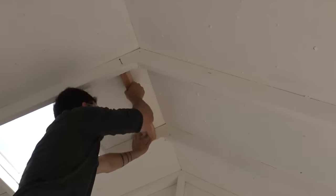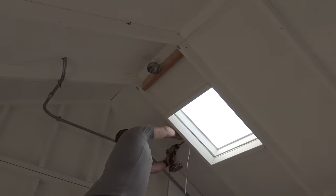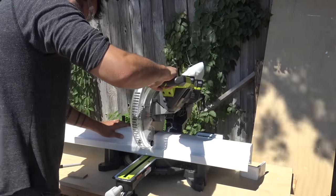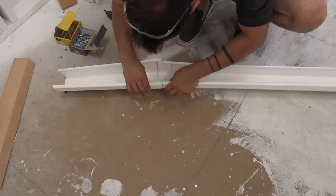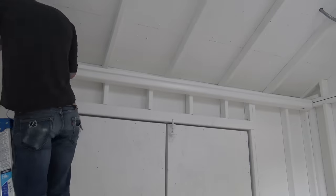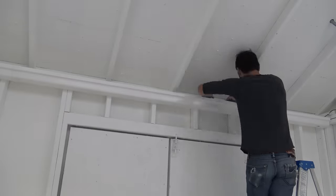We now turned our focus to lighting. We started by screwing pieces of 2x4 in between the rafters so that we could install nice industrial-looking pendant lights. All the lighting for the workshop will be connected to a second power strip which we will use as an on/off switch. Pendant lights are great for down lighting all the work surfaces, but I want the whole workshop to glow so I want to add some up lighting as well. I used my compound miter saw to cut lengths of rain gutter so that I could make some lighting coves. I used a coupling system to connect the pieces, pre-drilled holes in the back edge, and then installed them at the top of the walls. I drilled holes through the studs so that I could run wires to the LED lights that I want to place in the rain gutters. I then dropped in my lights and tested it out, and later redistributed the lights so that it was a little bit more even.